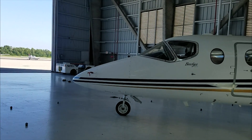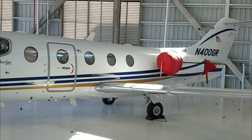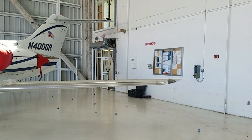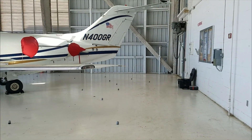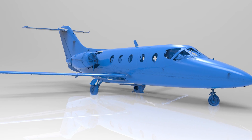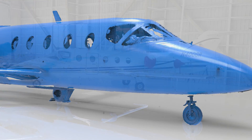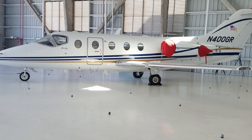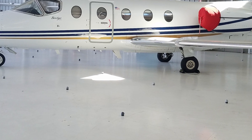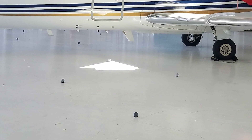The reason you want to be able to put the scanner on the ground and up high in other locations is because scanners are line of sight — the scanner has to be able to see what it's scanning. With large objects like this aircraft, we're going to need to take about 30 scans to get data on the whole aircraft. We need a good way to align all those data sets, since each scan has no correlation to the others. We've got spheres or targets on the ground, and in each scan we'll pick up at least four common spheres to allow us to align them.